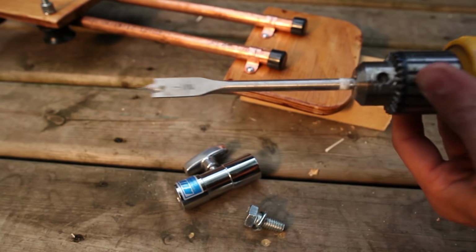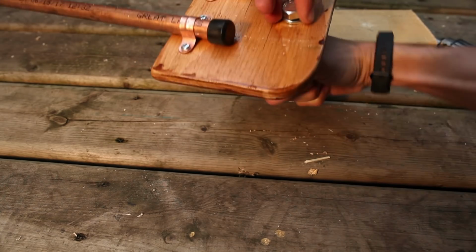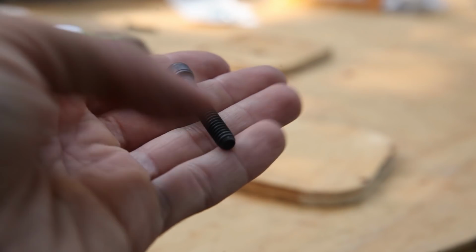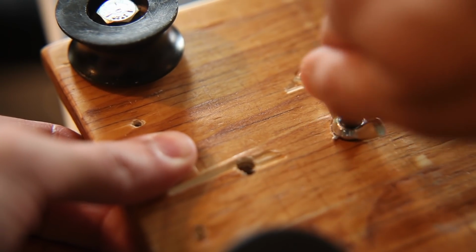I'm using a 1/2-inch hole saw to cut a hole in each end piece for the bolt of the TVMP adapter to go through. Once it is attached, we can now use our slider on top of C-stands. Using a 1/4-20 socket head cap screw and a wing nut, we'll be able to easily secure our camera or a tripod head to the top of our slider. And here are some cool slippery sliding shots taken from our DIY slider, which cost us around $35.